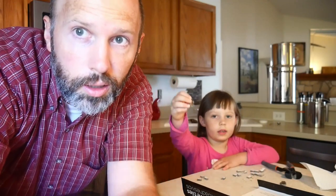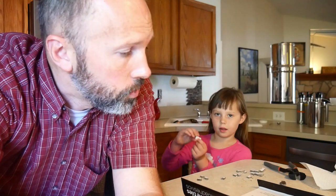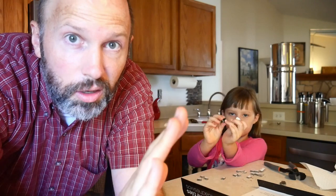I got a start on it. You can see it over there behind Hannah's head. Like that. She's got you. Yeah, right there. And so we got the first one up, and we're going to see how the rest of them go up. It's really easy. You just prepare the surface, get it nice and flat, then you spray a little soapy water on the back, which gives you some time to adjust it, and then you literally just stick it to the wall like a sticker. So here we go.